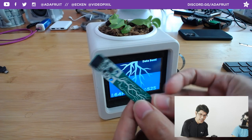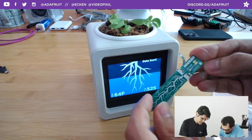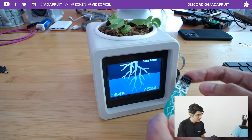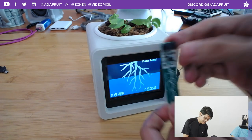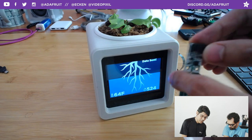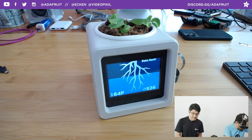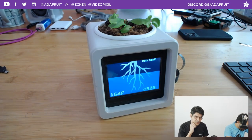It's using a fairly new soil sensor designed by Lamar — a capacitive-based soil sensor. It has a Stemma connector that literally plugs into the PyPortal Titano. It's I2C, pre-programmed, and works with CircuitPython, Raspberry Pi, Arduino, and more. I designed it so only the green PCB part goes into the soil — the electronics and connector are exposed outside the soil so they don't get wet. I think displaying the root system on screen rather than a face was a clever idea.